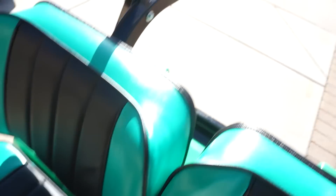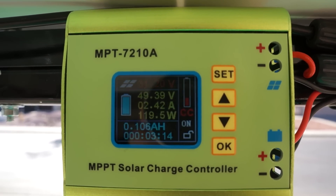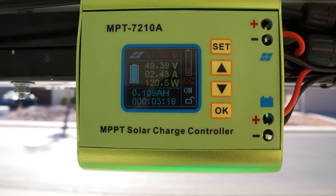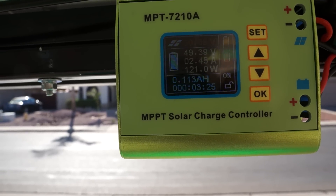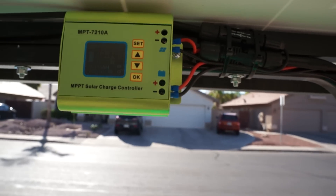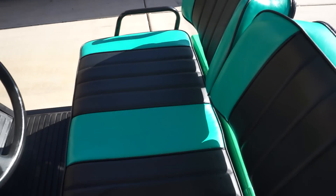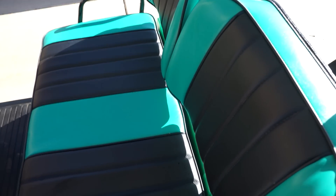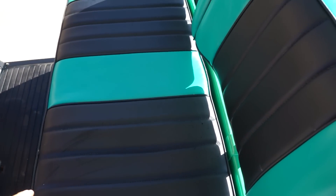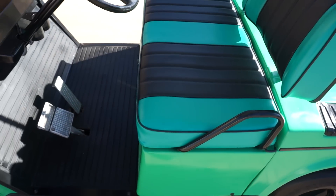It's now 7:30 in the morning and you can see it's putting in 120 watts — so it's charging the battery at 120 watts. At midday I think it maxes out around 180 to 200 watts. Even though this panel from the house can do 240 to 250 watts midday, this charge controller isn't a real MPPT so it only maxes out around 180 to 200 watts. Just a one-time test so it may be slightly off.